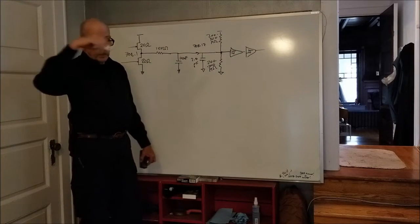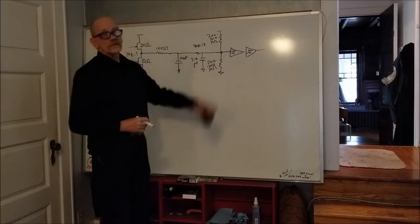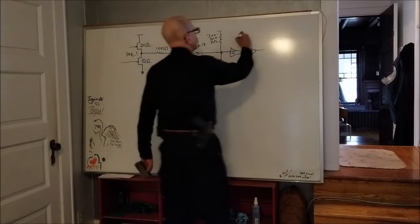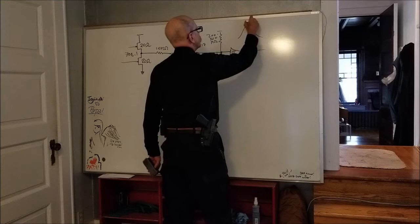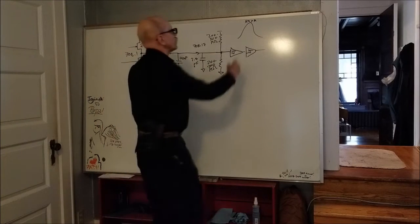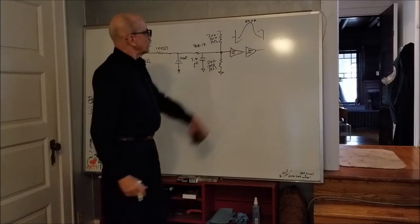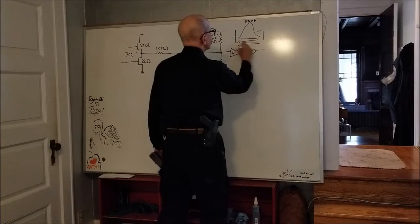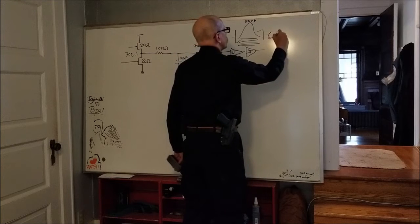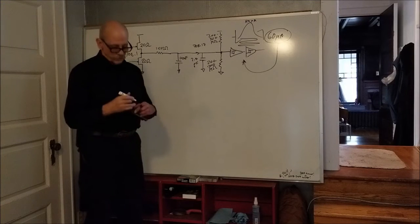And if we're running the signal continuously between the thresholds, the hysteresis bounds of these guys here, they're constantly conducting. That's just how Schmitts behave. The peak current was like 120 microamps for these Schmitts when the input voltage is right at the center, and it tails off on both sides. So here is this nice distribution of current consumption by these guys as we vary the signal right there in that range. So there is where our 60 microamps cost of these guys perceiving the slow-moving signal coming in.